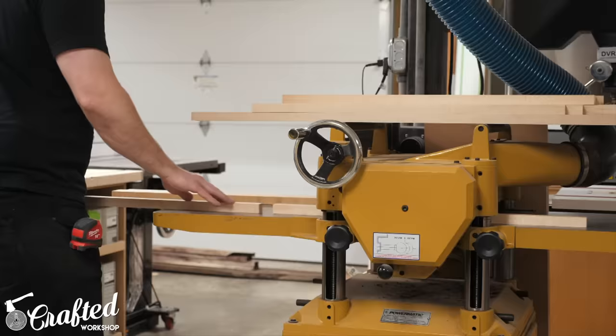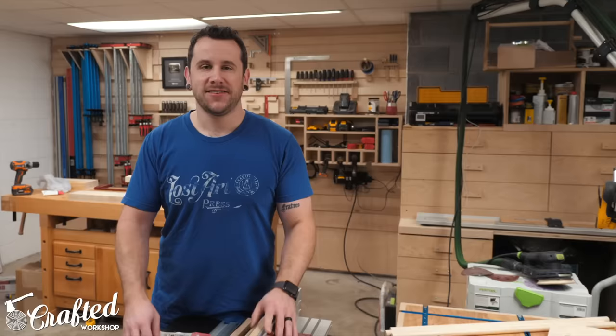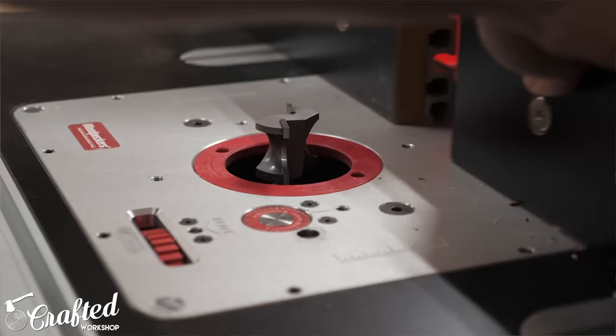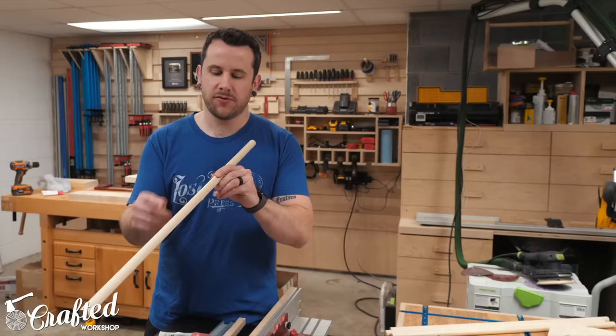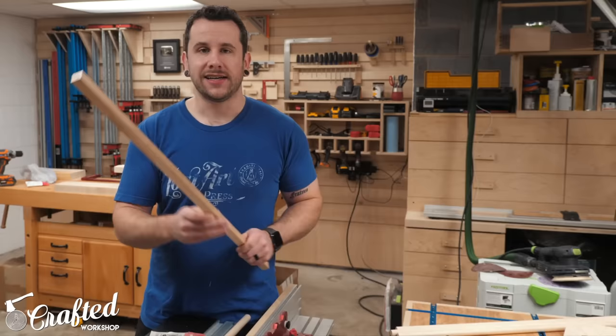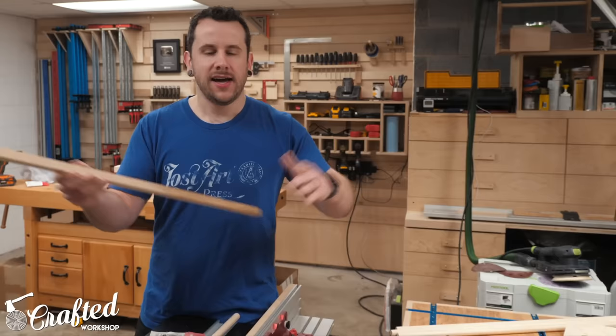After milling the spindles down to their final size, I got my router table set up with a half-round router bit to turn these spindles into three-quarter-inch dowels — or at least I tried to do that. After messing around on the router table for a good bit of time, I'm going to throw in the towel. I have a three-eighths-inch radius half-round bit and exact three-quarter-inch by three-quarter-inch stock, but for whatever reason it's still leaving a flat spot on the top and bottom of the dowel. I'm going to stop wasting this maple and move on to Plan B: creating tenons on the ends of all these sticks over the table saw using a dado stack, then adding a round-over to the edges to get something in between a dowel and a perfectly square piece of stock. I think it'll still look really good, and I can use traditional mortise and tenon joinery.